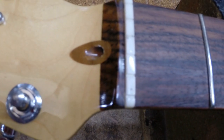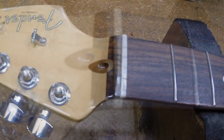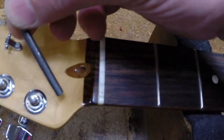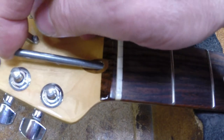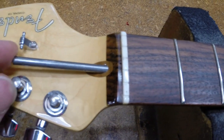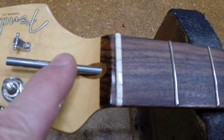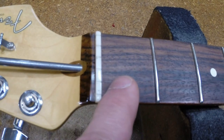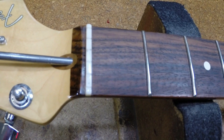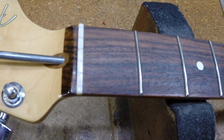We're going to do that with a couple little tools I've made. What I am planning on doing here is using a little metal insert I made several years ago. It's just a piece of 3/16 steel tubing - actually this is music wire, it's very hard. The plan is to heat this up well with my big soldering iron, and I'll have it long so it holds more heat. We want to heat up the area where the plug is glued in. If we're really lucky it'll slide right out, and if we're very lucky we'll be able to reuse it.